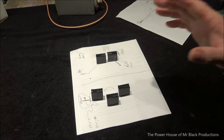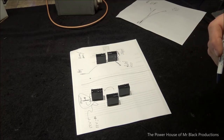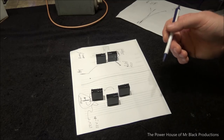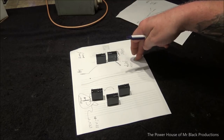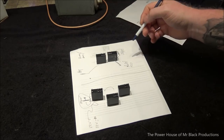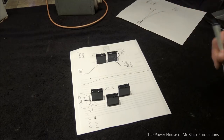Now, in theory, if you have the most ideal, perfect grounding system going on in your station, we don't have to worry about differential grounding current for each one of your audio leads. Like the 955, that's a four-pin jack, so therefore it's going to have a common ground on the mic for transmit and audio. Those two are going to be together, but the Icom is not the same way. The Icom has its own audio ground, which guys commonly tie together with the ground potential at the Icom, which is really not a smart way to do it. You see, there could be a possible differentiation in ground potential between the two circuits, and you're going to get a loop.